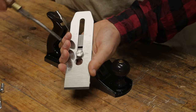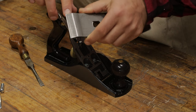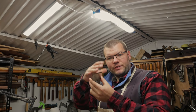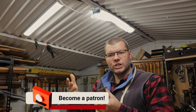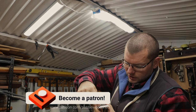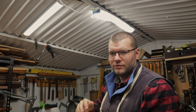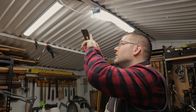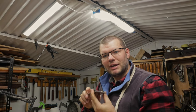Let's just go over here and check the mating of the chip breaker to the blade. If you haven't seen my videos where I check for this gap using light, I'll leave a link down below. Essentially you're looking up through this gap — if you can see any light along the front edge, you know that either the edge of the chip breaker is not flat or the back of the blade is not flat. It's going to be hard to show you on video, but in this case there is actually quite a big gap, so that would be something that would have to be fixed.